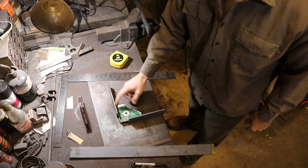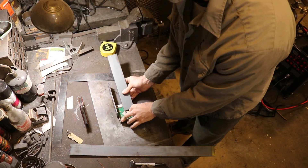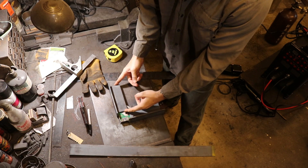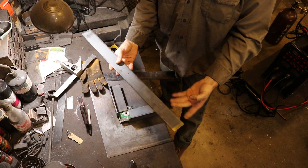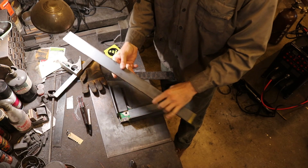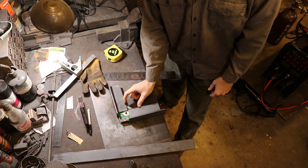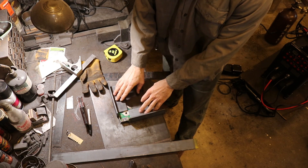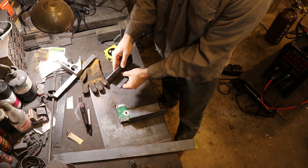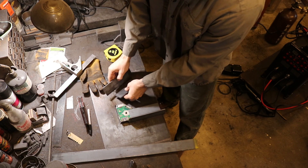Before I can do anything, I need to put the bottoms on these — basically making angle iron. I've got two more pieces cut to six inches, which made efficient use of my 26-inch flat stock. I still need to cut a reinforcing piece for the middle, but the plan is to weld these on the very bottom so I have a good 90-degree angle iron situation.